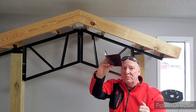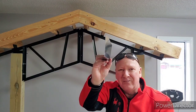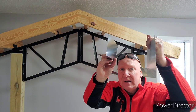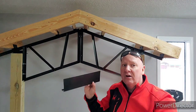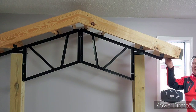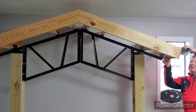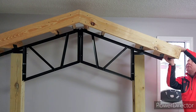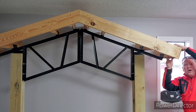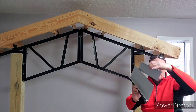On the eave sides, which is this piece right here, it's the same type of thing — it's just a small lip coming over like a two-by-four. This one's for a two-by-six, which we have on all of our stuff. It goes on the eave side right here, up under the metal roofing before you put the metal roofing down on the side. Some people call it a drip edge; we use the straight piece because it makes it cleaner if you're going to add gutters later.